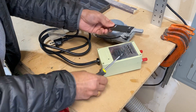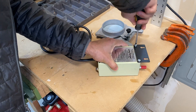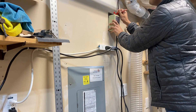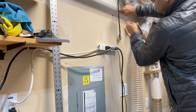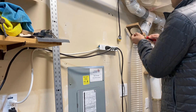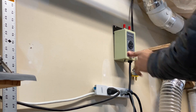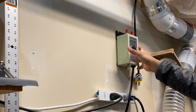The Long Ranger switch comes with some mounting hardware. Here I'm installing the bracket onto the box, which will be used to hang it on the wall. After identifying a suitable location on the wall, I marked the location of the mounting screws and then used a screwdriver to punch the holes. I used some drywall anchors and inserted them into those holes. Attaching the mounting hardware resulted in the box not sitting flush on the wall, so to make it sit more even I put some leftover rubber pads from a speaker box — after that the box sat much better.